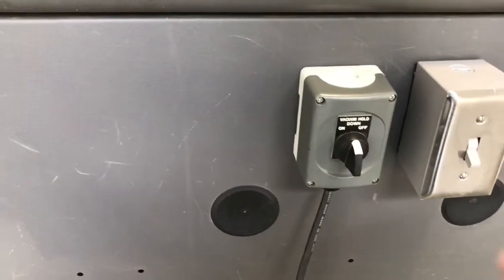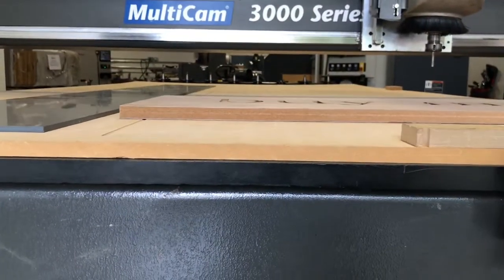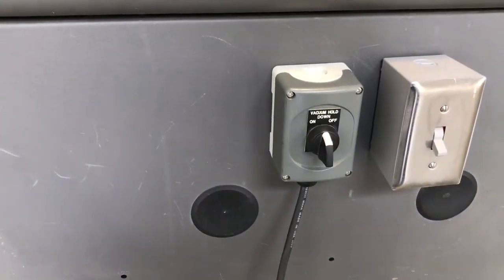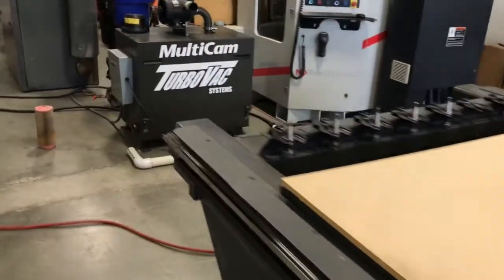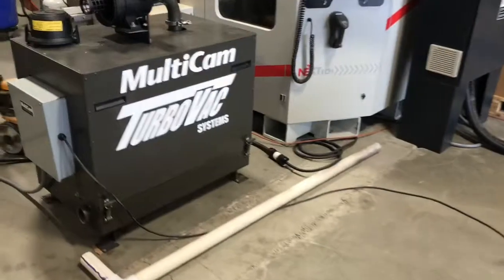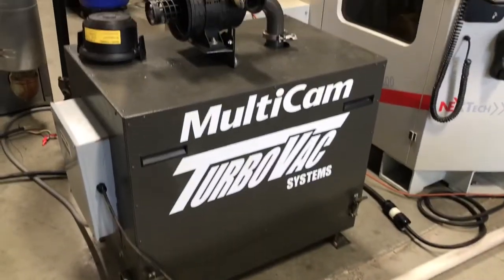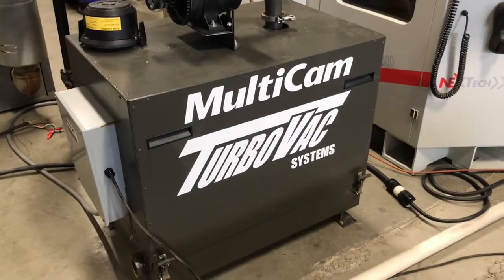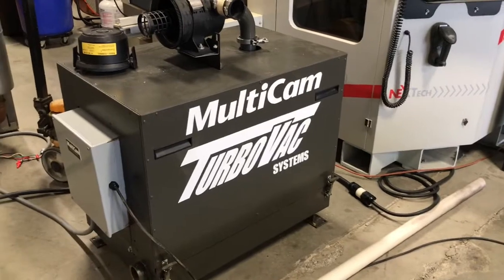To bump this, simply turn it on and then back off. You're going to have to have somebody back there at the vacuum pump to verify that the rotation is correct. And if it's not, you can swap one of the incoming power wires — you would do that inside the starter panel. Swap one of the wire locations; that will reverse the current direction. Make sure this thing is running in the right direction before putting full power to it and trying to pull down any material with the silks.